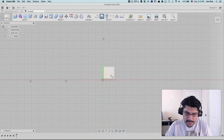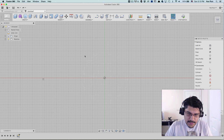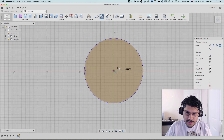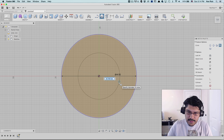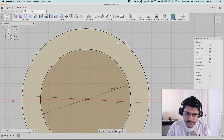Let's start off with modeling the NeoPixel ring. I start off with a circle, and I like to start in the center. Let me actually input the actual number — it's going to be 44.5mm, which is the outer diameter of the ring. It's really important to make your components first before you model the enclosure, because then you can be sure your stuff is going to fit around it. So there's the first circle. The next inner circle is 31.6 millimeters. Even though the board thickness changed, the ring diameters did not, so that's good. I'll move these sketch dimensions around so I can read them better.